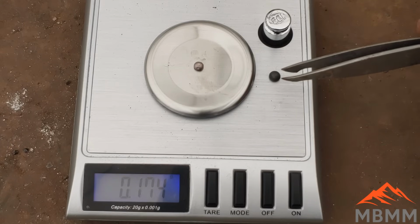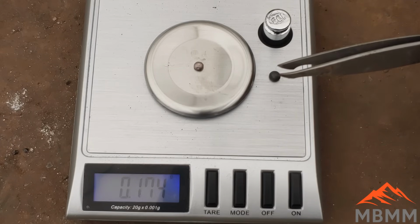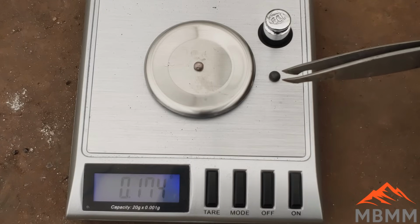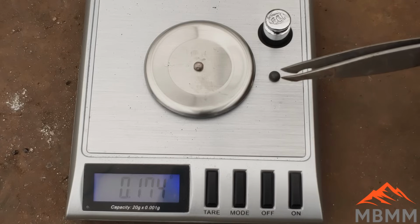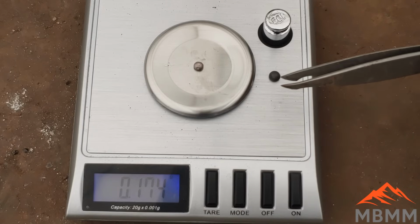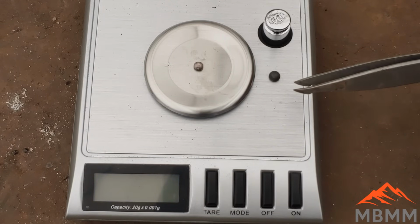And so now that we've done all of our experiments, it looks like the best recovery we get is using a lead collector and an acidic flux with not much lye or no lye, and just borax and silica sand. And the cool thing was that even with the borax and the silica sand, we got a total decomposition of the catalytic converters. So we don't actually need the lye in there to eat up that ceramic honeycomb.